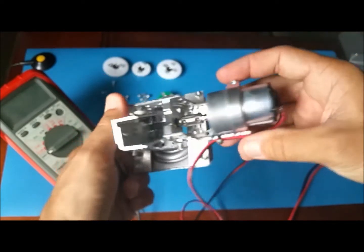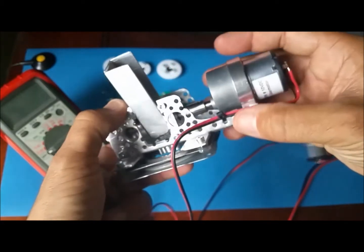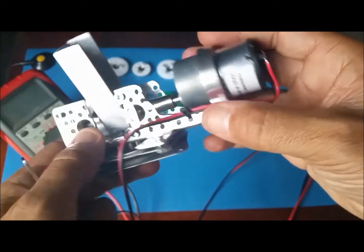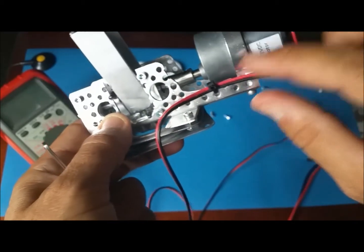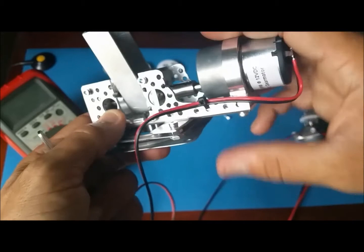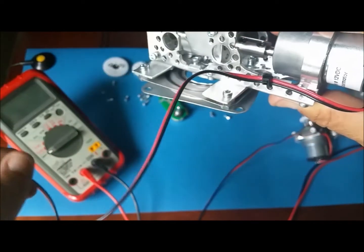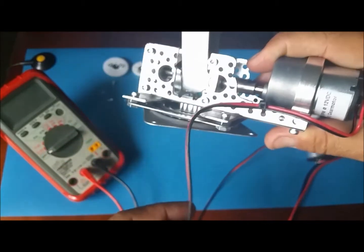This thing is tight. I also went ahead and put the wires, power here to the motor. I just soldered them to the motor, and then I put a tie wrap here, just strain relief, to take some pressure off the connection in case you pull or something, so it doesn't break loose from the motor. This is gonna go through that hole in there and into the box.